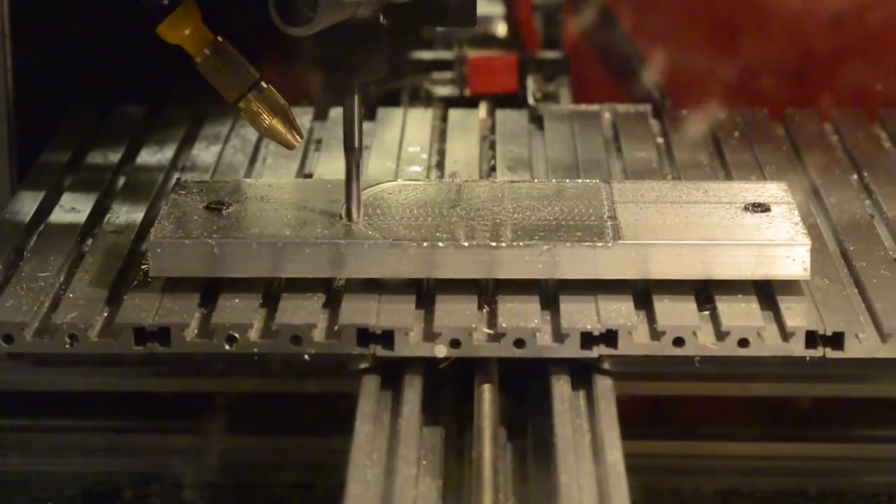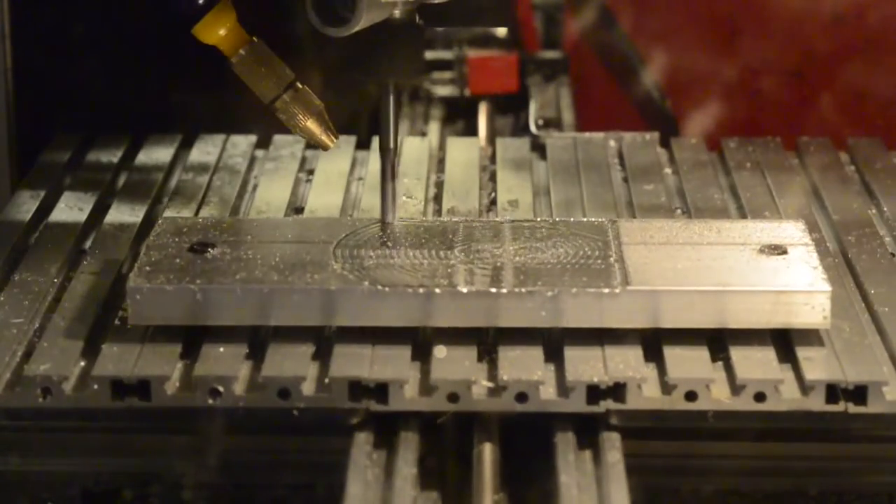I'm using the inductive style limit switches, which I feel are a little bit more reliable than the mechanical ones since they're solid state. I have targets throughout the machine which it actually locates those targets when homed.